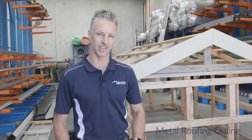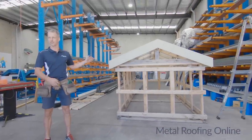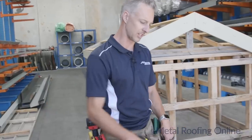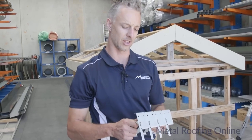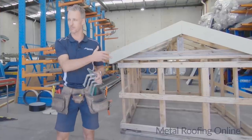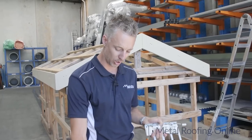Before we get started I'll just show you what you'll need for a job like this. This project is about four metres on each side, so you've got to order your guttering to the length you're after. You'll need the internal clips, which go about every one metre apart, and you'll need an extra one for the end — so for four metres you'd allow five clips on each side. You'll also need a pair of stop ends for both sides and some rivets and a couple of downpipe pops, depending on the size you're going for.